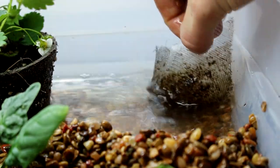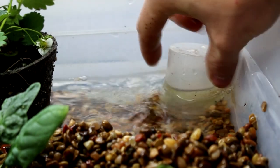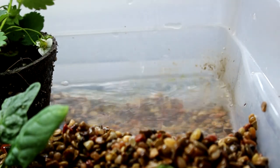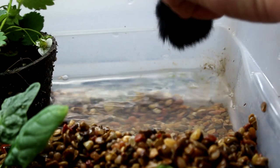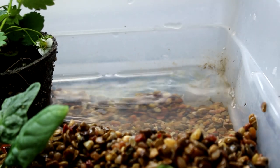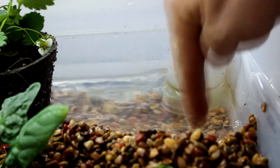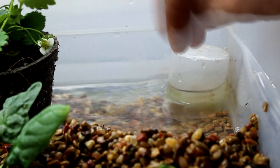Here's the screen that has been capturing quite a bit of gunk — I think I'll take this and clean it up. Now this little plastic cap here was mostly to deaden the sound, because this has air sucking down to the next level into the tank and it makes a lot of noise. If I pull this off you can hear it — yeah, sounds like somebody farting. That sound was a bit much to sleep with. This plastic cap has a pinhole on top so that when the system goes dry, water pushes the air out and starts the siphon, and then the cap creates a little suction so air doesn't get sucked through as much.